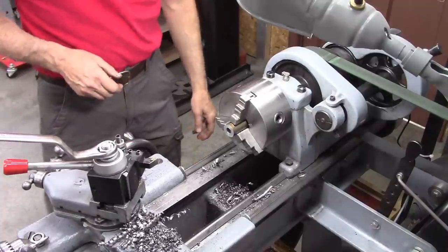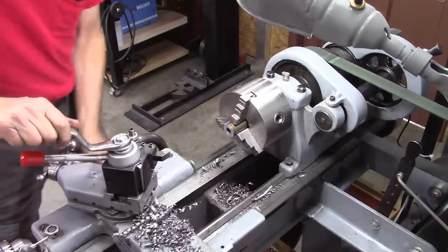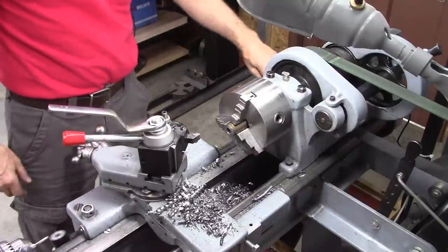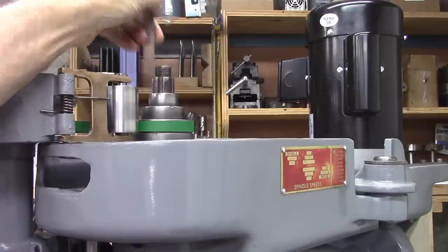Okay, this needs to go to 703 thousandths, which is the internal thread size. This is going to be kind of tricky. It's the internal thread size of that spindle over there. I think it was 3/4 deep, but I'm going to go measure again. It's a half inch deep.